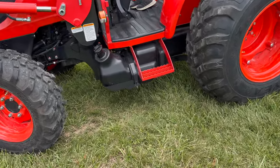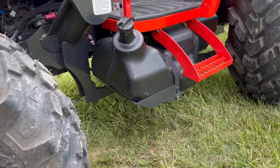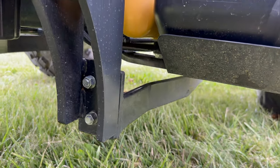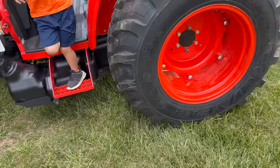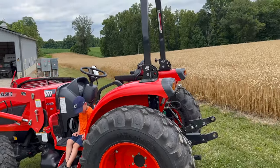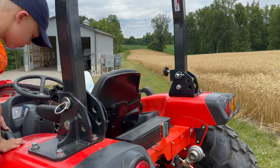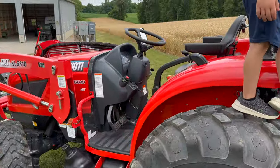On the side there is a fuel tank at the bottom with a step on this side, and the fuel tank has a solid steel guard protecting it. Looking underneath, you can see the loader frame hooks that run all the way back under the tractor on both sides for extra stability and increased front loader capacity. The ROPS can be lowered but I always recommend keeping them up for safety. They have three different height positions. Do not drill into the ROPS — use brackets instead.